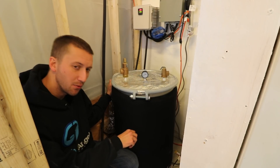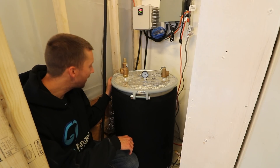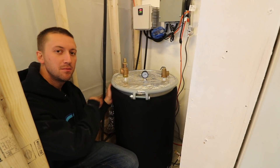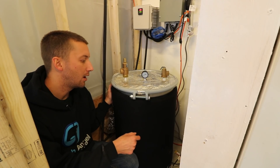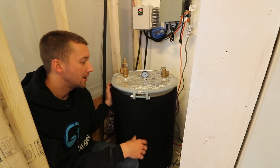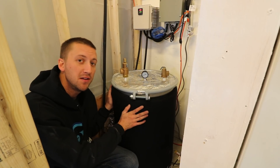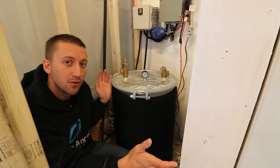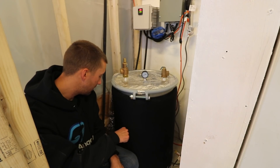It has a one-and-a-half inch pipe threading on the top, and it pumps steam into whatever you have. You can use this for generating steam for multiple troughs, a steam shed, a proofer, or whatever. You can even do a bunch of drums — 55 or 130-gallon drums — and have one of these with a valve that switches to which one it runs to. It's similar to what Brian Callow has, where he has a 10-gang of drums with one or two boilers. That makes it so this thing will be running more often, and you just switch the steam.